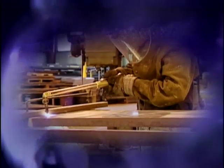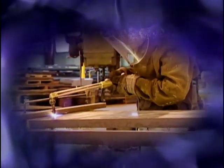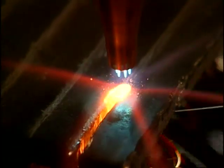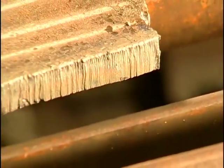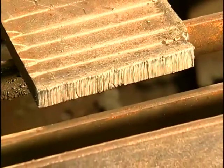The oxyacetylene torch is commonly used for cutting metals. Oxyacetylene cutting of mild steel is fast and easy. An oxyacetylene torch can be used to cut mild steel in thicknesses ranging from sheet metal to plates several inches thick. When properly performed, oxyacetylene cutting of plates can be as clean and accurate as if the plate had been sawed.